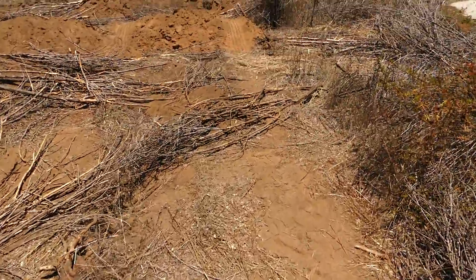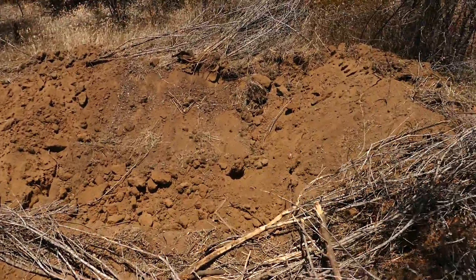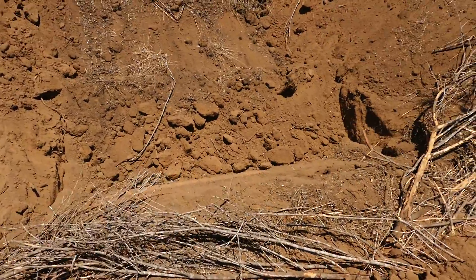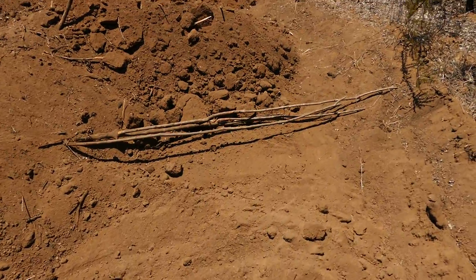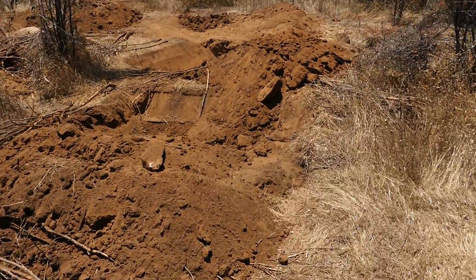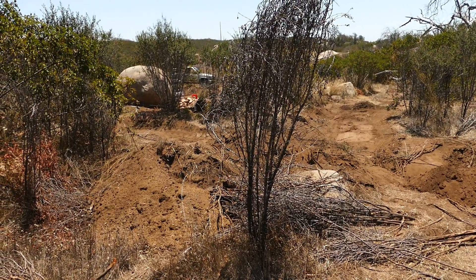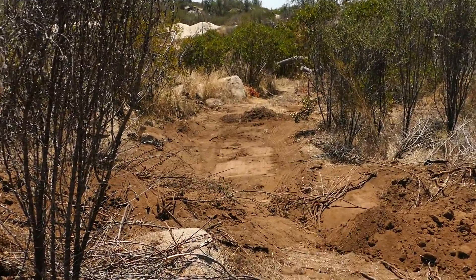Going uphill from the house, I've started some earthworks too. Basically this is the highest point, so when water comes in it'll hit this little basin as well as a berm following along here. What'll happen is it'll get stuck in this basin, overflow to the next basin, that one fills up and overflows to the next one, and again and again — it flows to this one, flows to that one, flows to that one — and then it meets back up around where water would be coming from the other direction, and all that water will flow down this path.